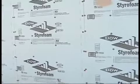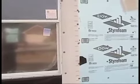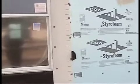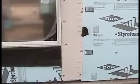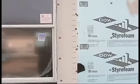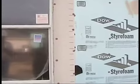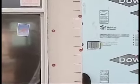Now, next to the blue board, we have what's called Thermoply. Now, it's very important to make sure, believe it or not, the Thermoply can be used around your doors and windows. It may be hard to understand this, but this stuff actually has some structural integrity to it. It gives a little extra added strength. Now, in my perfect house, I would have OSB board or plywood used here, but they've used this Thermoply, which is adequate, I guess I would point out. It's very important to make sure they have the red writing on this Thermoply. They make a green one, which is for inside only, not to be used outside. There's several times I've caught them using the green lettered Thermoply rather than the red.